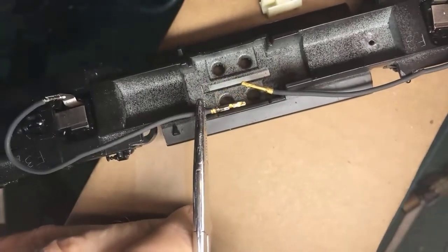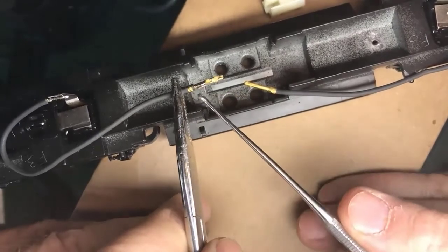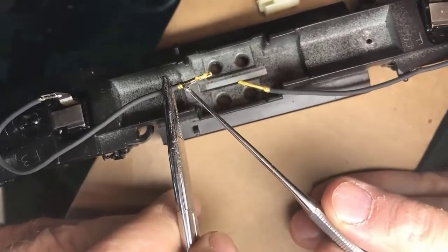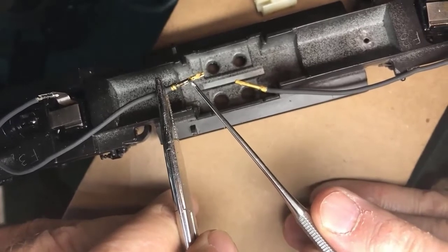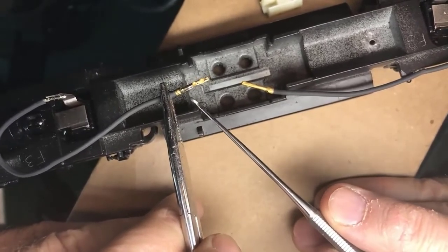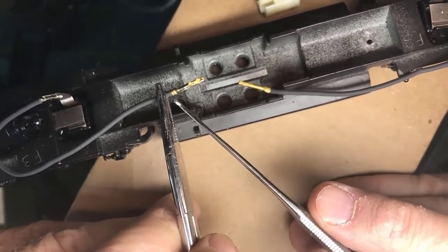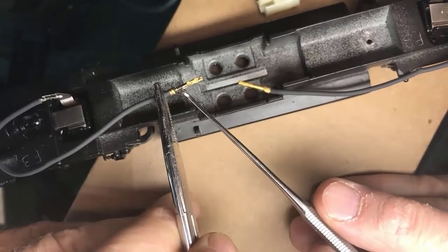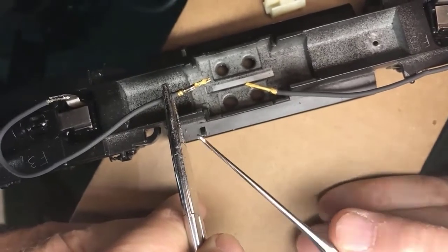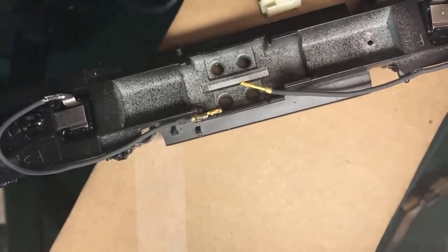the work. And this is practice, gentlemen. There's nothing here but practice, but you can probably see shiny silver here. But it isn't here. It didn't flow up into there. And it mostly was fresh, clean solder, a pre-tinned wire, because I pre-tinned this wire before I crimped it in there. So it was ready to receive the solder.